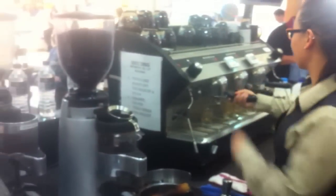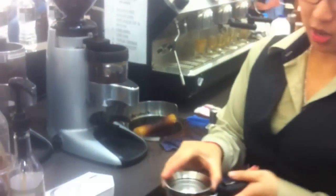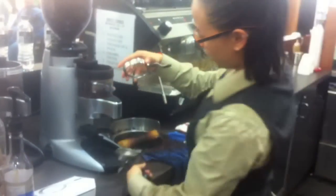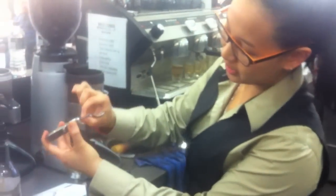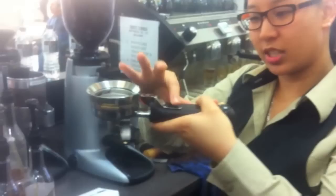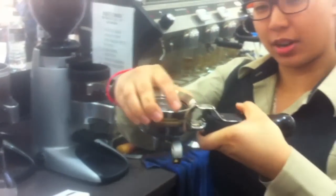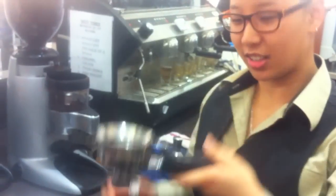So it just sits up here on your grinder. Take out your handle, put it on. Now when you put it on, you need to make sure that you bend it there, so when it sits on, the tip of it just touches the handle like that. You might need to bend it a little bit just to get that right, just to get it sitting on like that.